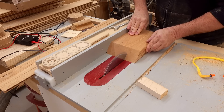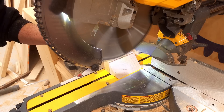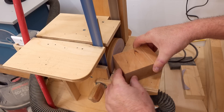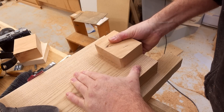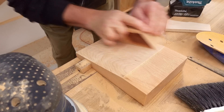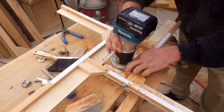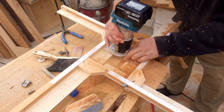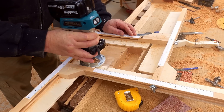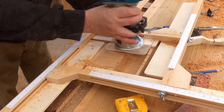Without going into too much detail, I had to cut a lot of angles here. The stand is in three parts: the base, the upright, and the insert that goes in that notch I cut in the baffle — and it all needs to fit together seamlessly. I needed a place to put the crossover for the speaker, so I'm making a cavity in the base for it to fit into. While I'm at it I'm going to route out a recess for a steel cover plate that will also add a little weight to the base and give it more stability.